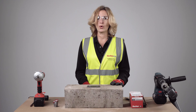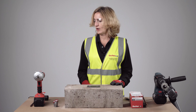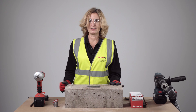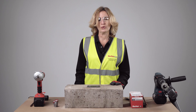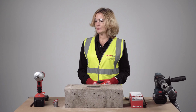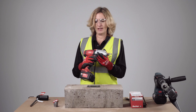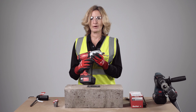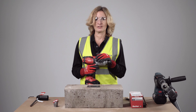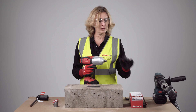Torque must also be reduced if you are fixing into green concrete or masonry materials, where you will be using a manual torque wrench. In that case you would have to reduce the torque to 5 to 50 Nm depending on the material. Always refer to the published data. In our demonstration we will be using the Fischer FSS 600 impact wrench, which generates torque up to 650 Nm — the correct tool for this product.